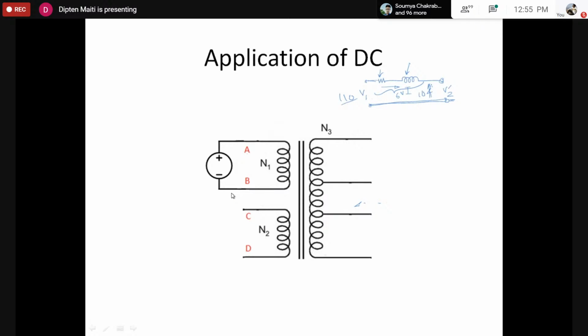So you should not say that the transformer resistance and reactance limit the current. Of course, that is valid from Ohm's law. However, that is not the main point. The actual limiting factor is the back EMF. Got my point, or any confusion? I am coming into the flux point of view. So don't say that reactance or resistance limits the current.